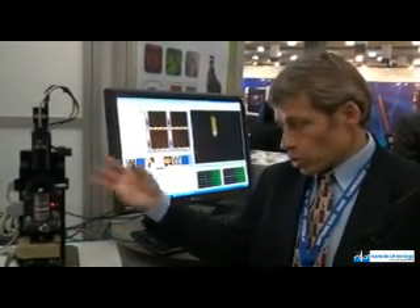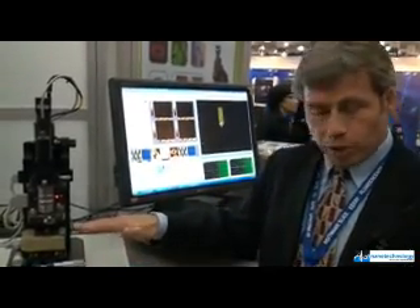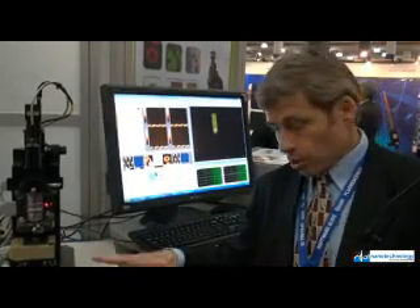That somewhat summarizes what you're looking at with atomic force microscopy. Keep in mind that you can get the truest of images by doing true non-contact — the tip not in intimate contact, not blunting the tip, but staying very proximate to the surface you're trying to inspect.